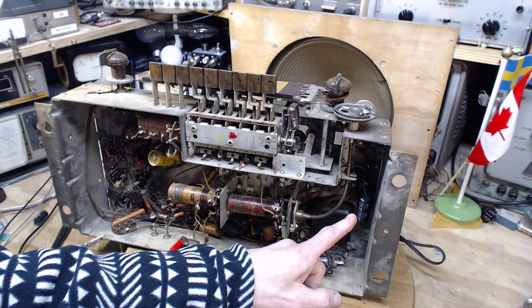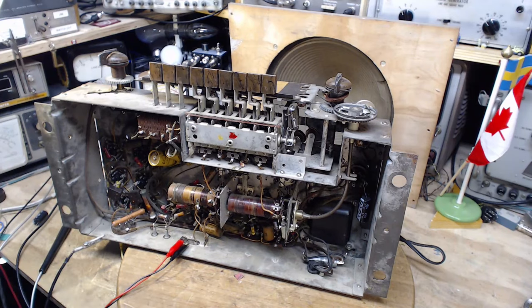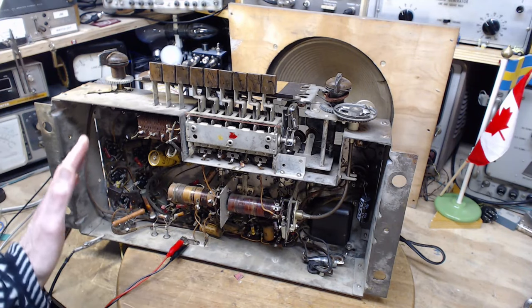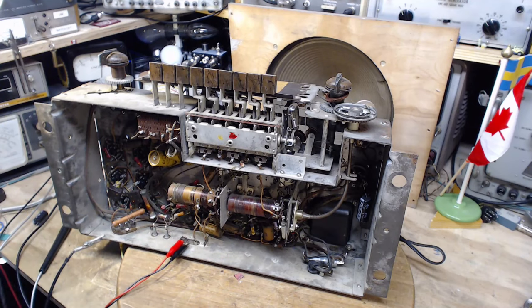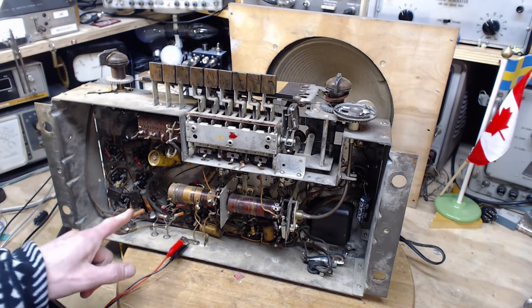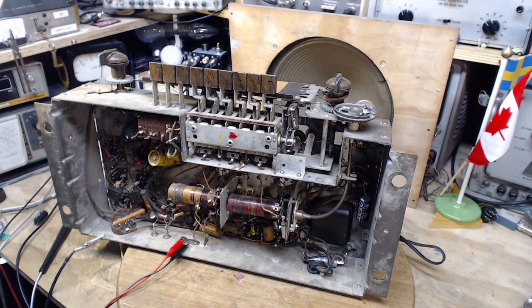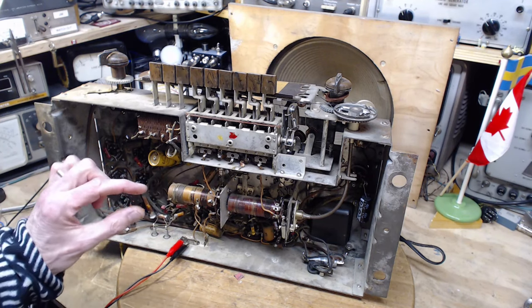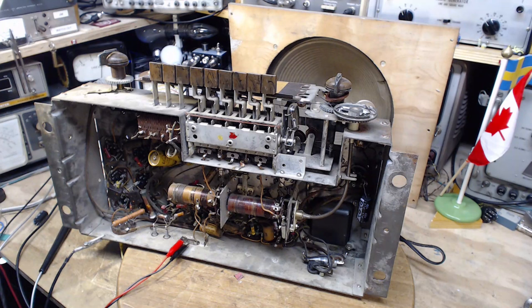And I don't remember what the measurement was on the original capacitor voltage. So yeah, if there's something going on in this radio which is really pulling the B plus current, that would result in a higher temperature of this resistor and a lower reading on the far side. The schematic is full of lines where it says how much current is flowing on the schematic. Let's just take a look and kind of loosely add those up and just see what kind of current is supposed to be flowing here.